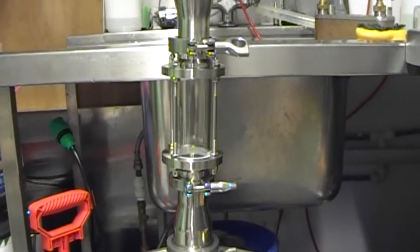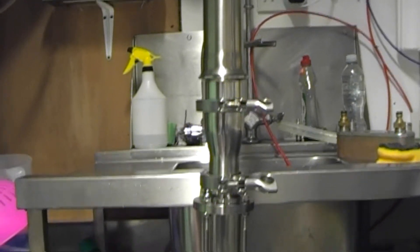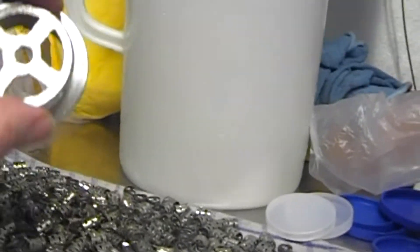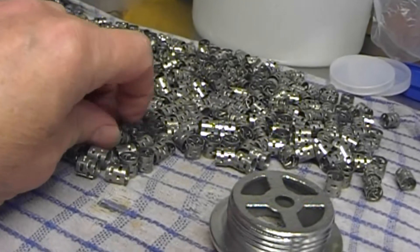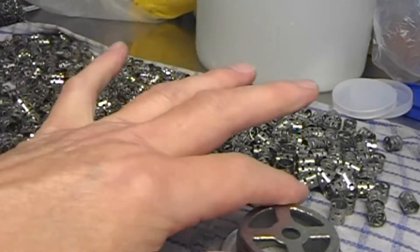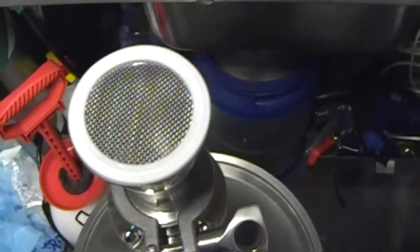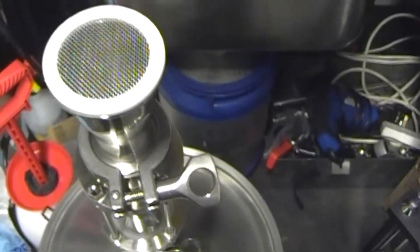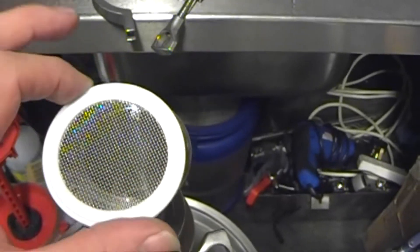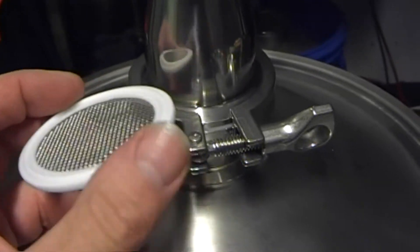At a later stage I will probably buy the glass column with the bubbler plates. Your media that goes inside your normal column - your fitting would normally retain it at the back there - screws into the end of your column and stops everything falling out. So you need to either use a stainless steel or copper scrubber stuffed in the end, or use a filter screen bonded into your tri-clamp gasket. I personally would still pack the column with some form of copper or stainless scrubber.